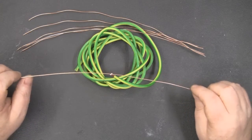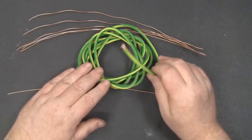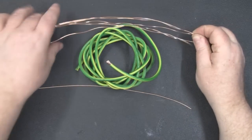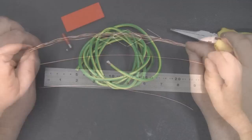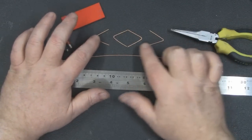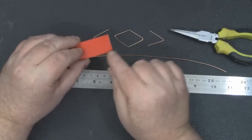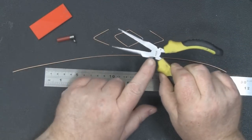The copper wire I'm going to use is around 21 SWG, and I've got it from multi-core earth wire — just buy a few meters, cut to length, strip it back, and you get quite a few strands of copper wire. It's a cheap way of getting copper wire to build antennas. I need to make two V-shaped elements and one diamond-shaped element. I've got a 25 millimeter tube and a piece of perspex measuring 25 millimeters across to help me, along with my needle-nose pliers.